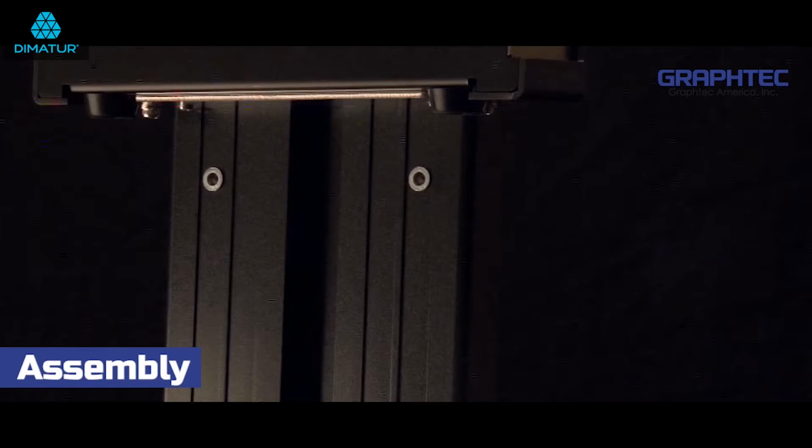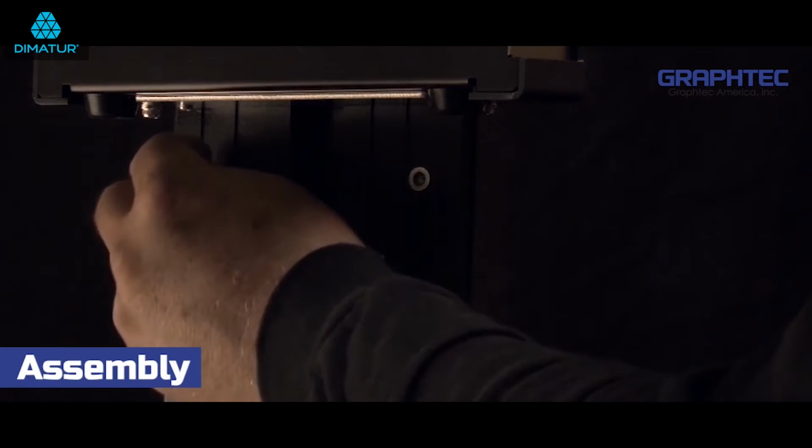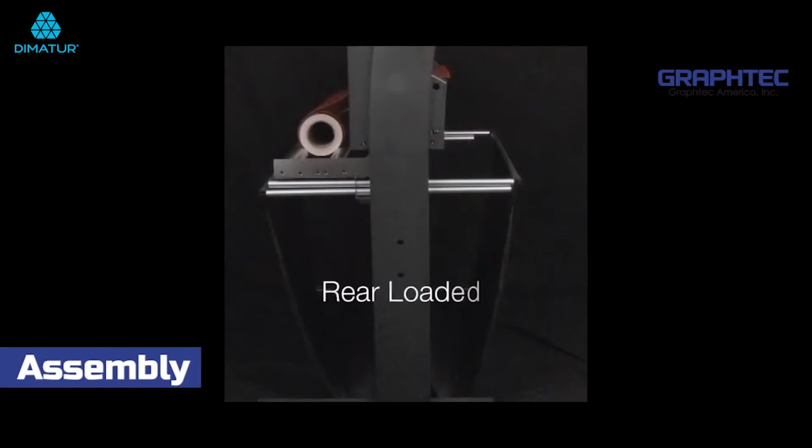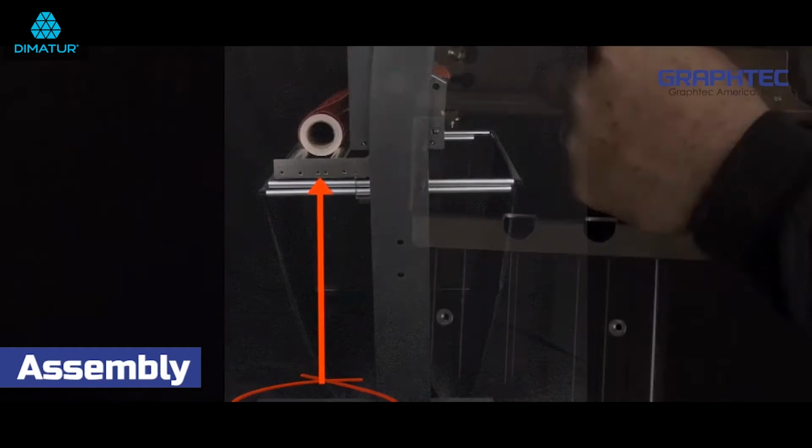Mount the 2 media stock roller plates with the attached mounting brackets to the inside of each stand leg on the underside of the cutter. Insert 1 screw in the front. Make sure when mounting them that they face the direction of the longer footer stems. Notice that the longer end of the footer is always under the stock rollers and media.